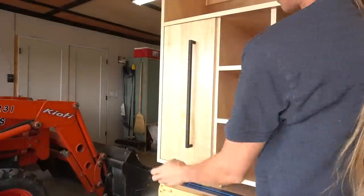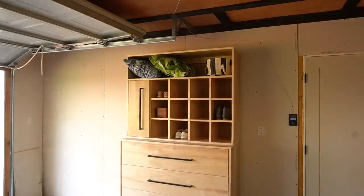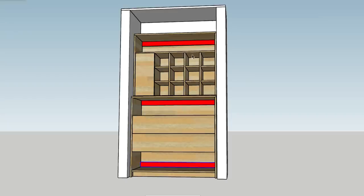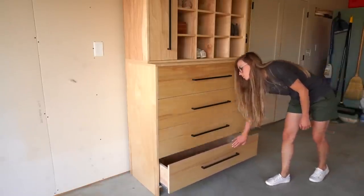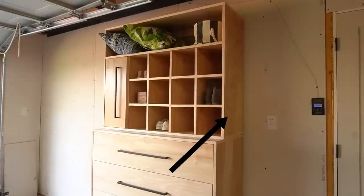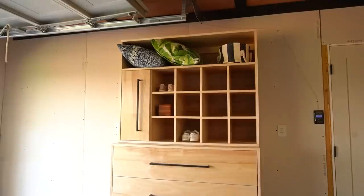Broken down into sections, this project really wasn't difficult, though it is rather large. It could easily be modified, added onto, or doubled up to fit a nook, closet, laundry room, or any space needing extra cabinetry or storage. To install, you'd attach the cabinets to the back wall through the back braces into the studs, then use a few screws through the underside of the dresser top to secure the top cabinet to the bottom as one big unit. With this natural birch finish, the wood putty is almost unnoticeable. If the sides were exposed, adding a veneer, wood plugs, an end-cap board, or trim pieces are easy ways to cover screws and give a seamless finish.